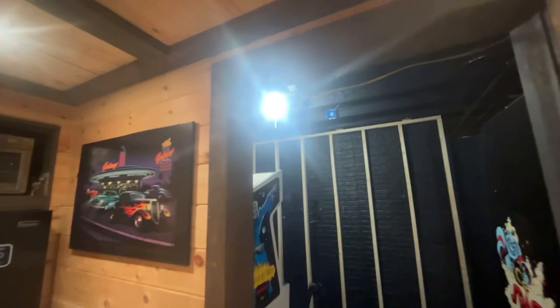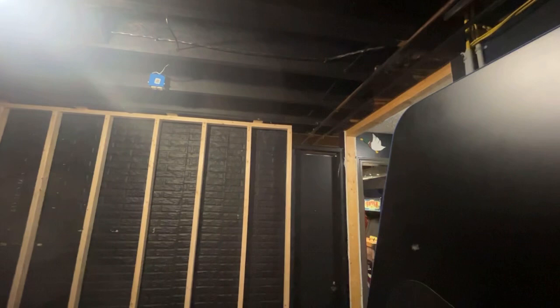When I cut my side pieces right here and they get the trim screws in them, that's what holds the panel up. I'll make them the same width as this room so all the rooms will match height-wise. I'm going to split this into three tiles wide — one, two, three — because I don't want to make these panels too big and have them be too heavy to bring down if you need to get up there for plumbing.